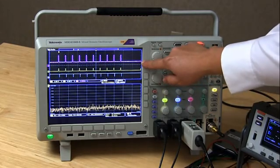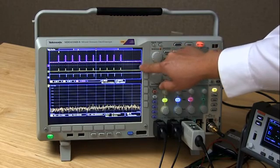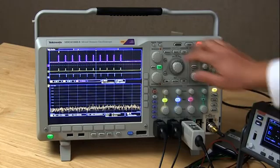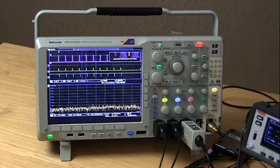Looking at the purple line, we can clearly see 10 separate current pulses, each with a corresponding trigger pulse in yellow and a meter complete pulse in blue. Using the on-screen cursors, we can see that the current matches what was measured by the Model 2280S power supply at about 16.3 milliamps.